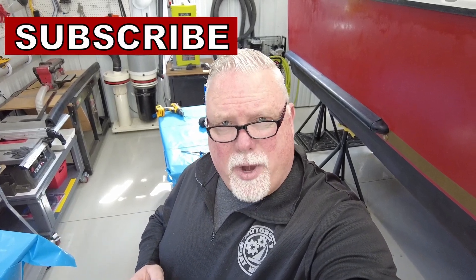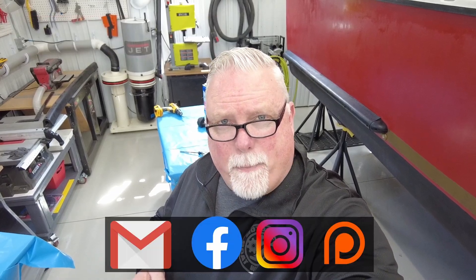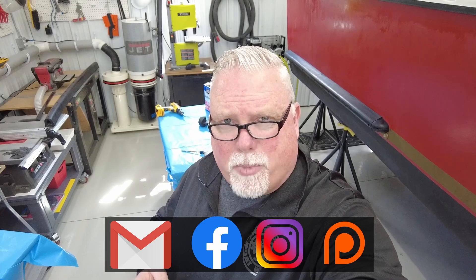If you're enjoying this episode, please hit the like button and leave a comment below. I invite you to subscribe, and if you really want to help out the channel, please consider leaving a donation on Patreon. Now, an important reminder: the cheater block technique is not for structural components on a boat. It is a poor man's way to retrofit fiberglass components back into a fiberglass hull when the hull is not thick enough for mechanical attachment. For load-bearing bulkheads, structural bulkheads, steps, and things like that — those need to be permanently mounted to the hull, and cheater blocks is not the way to do that.